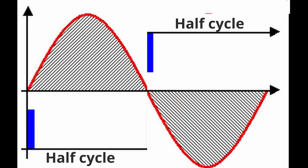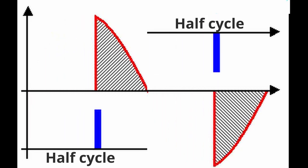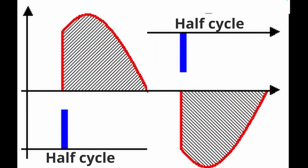Let's say I have the switch off. After the phase crosses the zero point, called the zero crossing, I start counting. I'll count to 5, with each count being 1 millisecond long. Now I'll turn the switch on until the phase moves to zero again, then turn it off and start counting again. This way I have delivered only half of the power to my lamp. By changing the length of my count, I can thus change the brightness of the light.